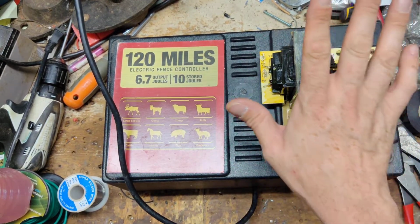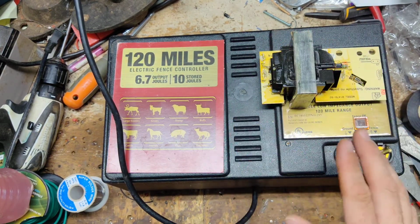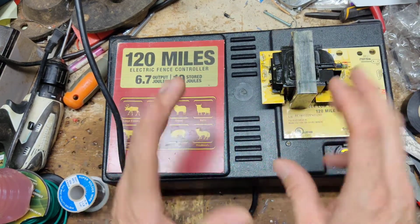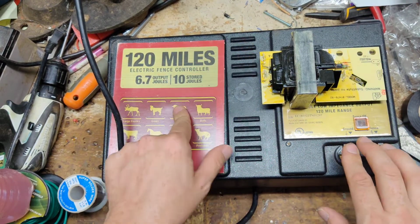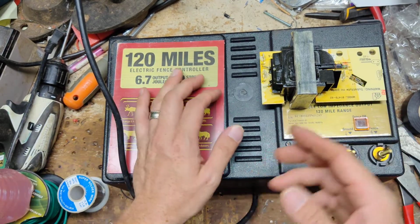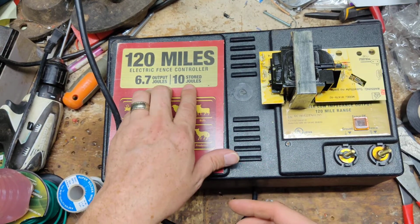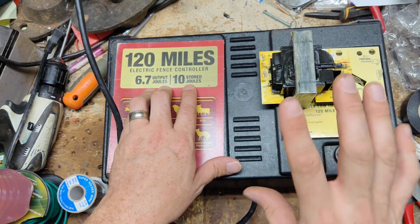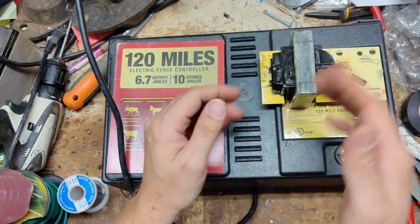But going back to the power on demand and adaptive control units made by other brands, basically what those units do, through software and chips and monitoring, is feel the resistance that's hooked up to it. Say this was a Gallagher M1100, a $500 unit, give or take. It's an 11 store joule, 7.7 output joule unit. So a little bit stronger than this, but about twice the price of this one. They use a combination of adaptive control and the multi-core transformer setup